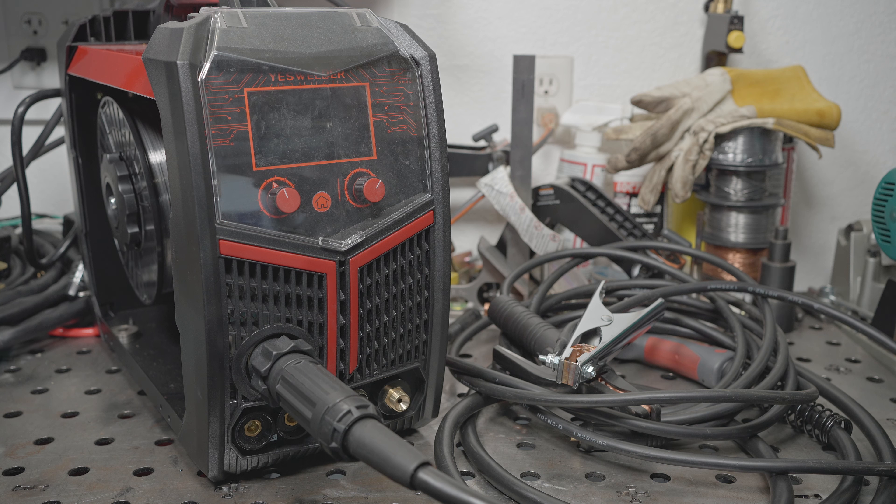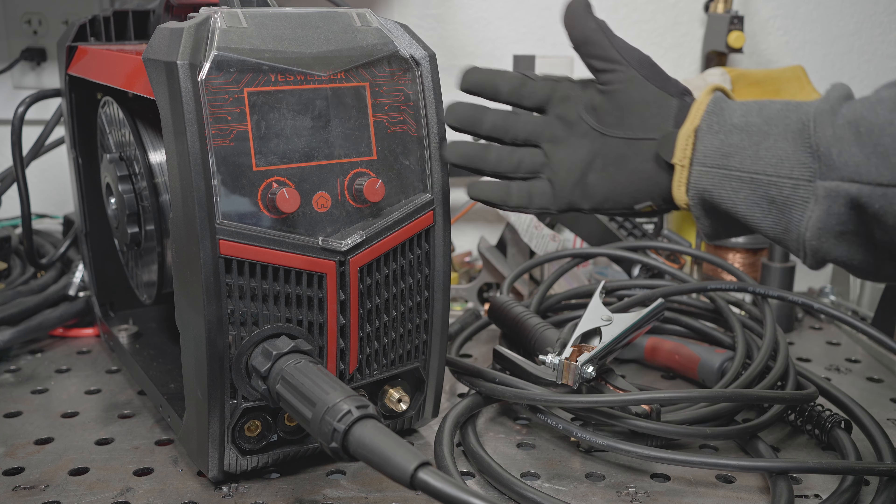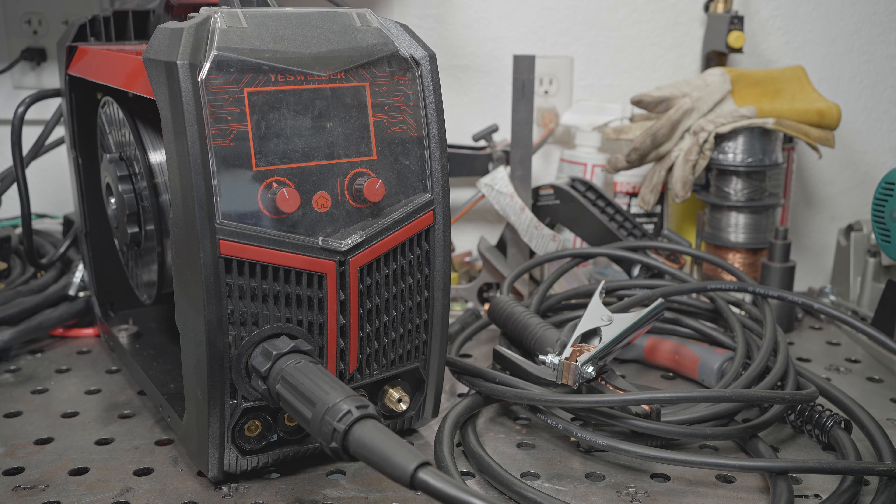Honestly, from all my testing so far, this machine seems to perform the same and have almost the exact same functionality as the MIG 205DS but with a plasma cutter tacked on — yet it's two and a half times the price. Sure, the MP200 has a fancy display and memory settings, but other than that this latest and greatest YesWelder, with millions of dollars of Kickstarter funding, is essentially the same as their MIG 205DS except with a plasma cutter built in. It still has outright lies about output, it has the misleading claim of lift-start TIG which is actually scratch start, plus it has a 6010 mode and proudly claims to run 6010 but doesn't seem any more 6010-capable than any other welder they sell.